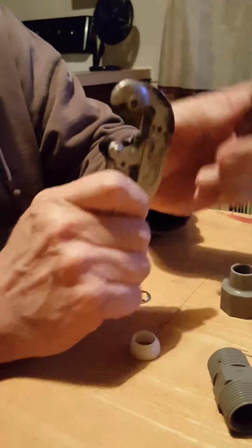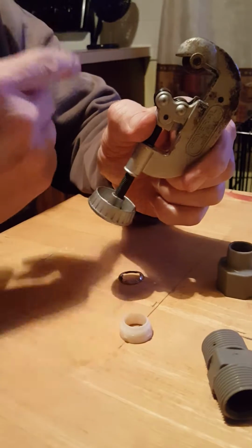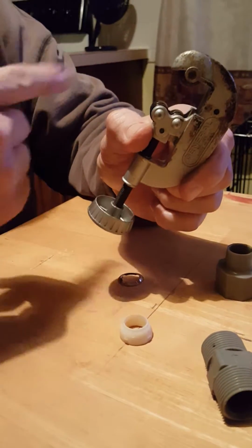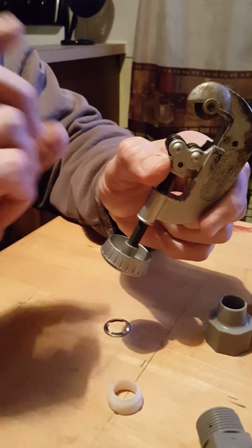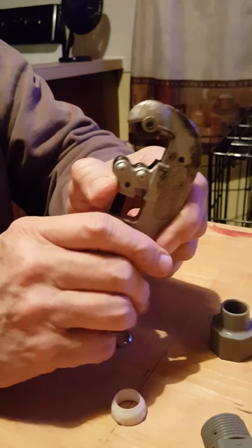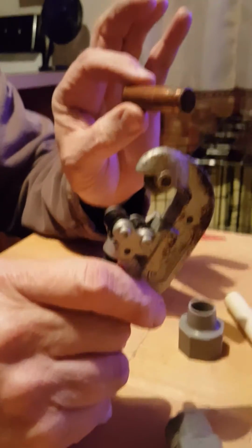So what you're going to do, I saw in the picture you have that green corrosion. Go backwards past that green corrosion until you get a piece of the pipe where there's no corrosion on that at all. Corrosion, what I mean by corrosion is all that green stuff that's built up on there. Okay? So just say this is the pipe that you're going to cut.